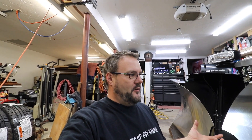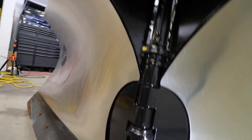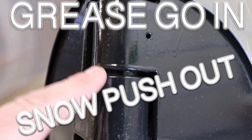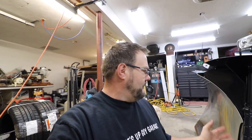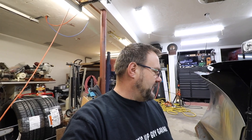Just take this piece and because it has that flat section, it creates a seal around the end. That way you're putting minimal effort into actually putting grease in here. Just like any other piece that you grease with a grease gun, you basically wait until you see the grease start to come out and then you stop. After every time I plow a storm where I know I've actually abused this portion of the plow — breaking up piles — there is enough of a gap where snow can get into these grooves and push all that grease out. When that happens, you've got no protection. So after every storm, that hinge pin, that center pin, because it's greasable, it takes what, a minute to grease that pin? And it's so well worth it.